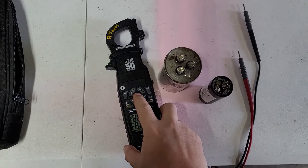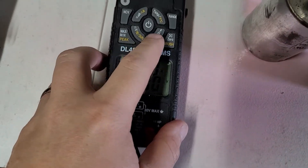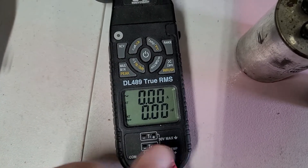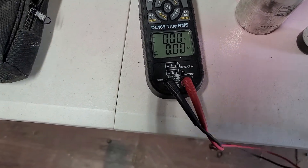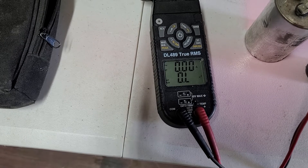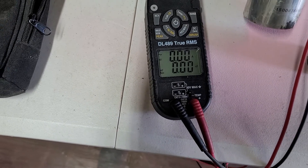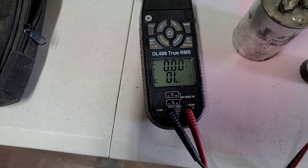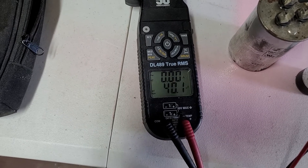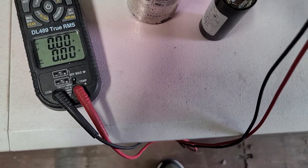So we're going to try it again and see what happens. He was right in the comment. Let's see — so this was the setting here, that's nanofarads. If I try to read a capacitor on that setting, it's interesting that it actually starts out in nanofarads. It eventually gets there. I know this is a 40 plus 5 capacitor, but if you try to read the 40 side of it, sometimes it just does all that guessing and trying to figure out, and eventually gets there.